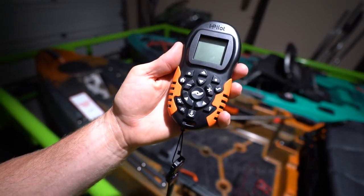Lastly you've got cruise control. You'll use this when there's a bit of breeze, some slight chop, or you're going upwind against current. If you want to travel along the bank at two miles an hour, without cruise control you might breezing through some spots then slowing down based on wind and current. With cruise control it modifies the propeller speed output to keep you at that set pace. Whether you want to do one, two, or three miles per hour down the bank line you can set it at that exact speed and maintain it regardless of current and wind. That wraps up all the buttons on the remote - hope you enjoyed this and we look forward to launching this thing in the next video.